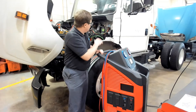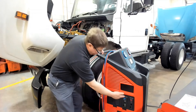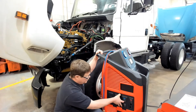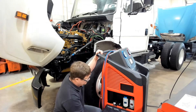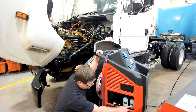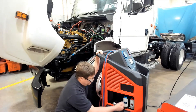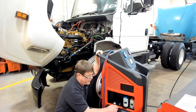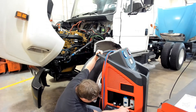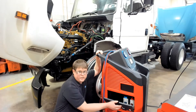We check the oil level so we can recognize any oil captured during recovery. Right on the side of this machine, you'll notice we have a bottle for new PAG oil as well as used. Open this up so you can see it better. You want to take note of your current level in the used oil, or empty it if it's getting close to full, so that when it purges the oil out you know how much was captured from this vehicle in particular. Right here we can see we're just a little below 100 milliliters.